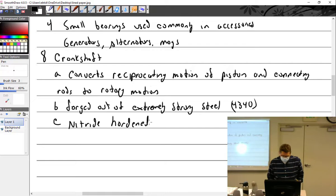They put it in an anhydrous ammonia gas in a heater at about 975 degrees for 40 hours. Before I understood the process, I used to send crankshafts off for grinding. Continental, you have standard and then 10 under — whenever you went 10 under you had to send it out and have it ground down and then re-nitride it. I'd get calls saying 'we lost your crankshaft in nitriding' — meaning it cracked because of the heat. They didn't always make it through the nitriding process.